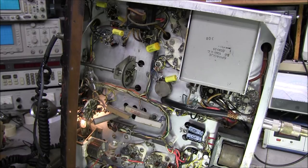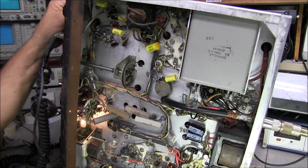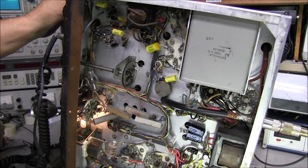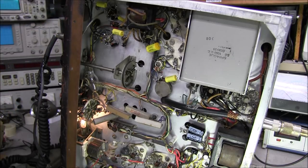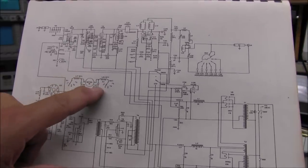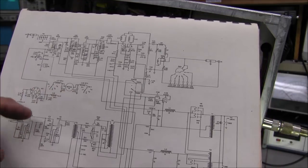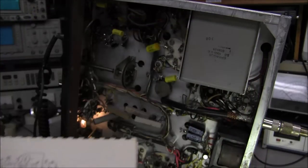What I'm not liking is that when I go to the meter on oscillator buffer and grid, the meter is working fine. But when I go to plate, the plate meter does not work. Also when I go to modulation, there is nothing on the meter. I've looked at the schematic and I don't see any shunt resistors or anything in there, so I'm going to have to get in here and troubleshoot this meter circuit. There are a couple of caps on the meter — I don't think that's the problem — but we'll need to get in here and find out what's going on with the meter. We'll do that in the next video.